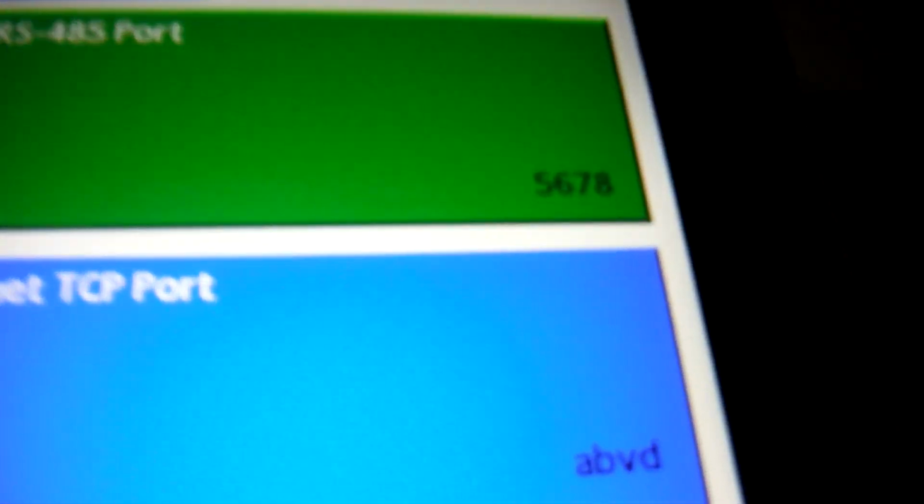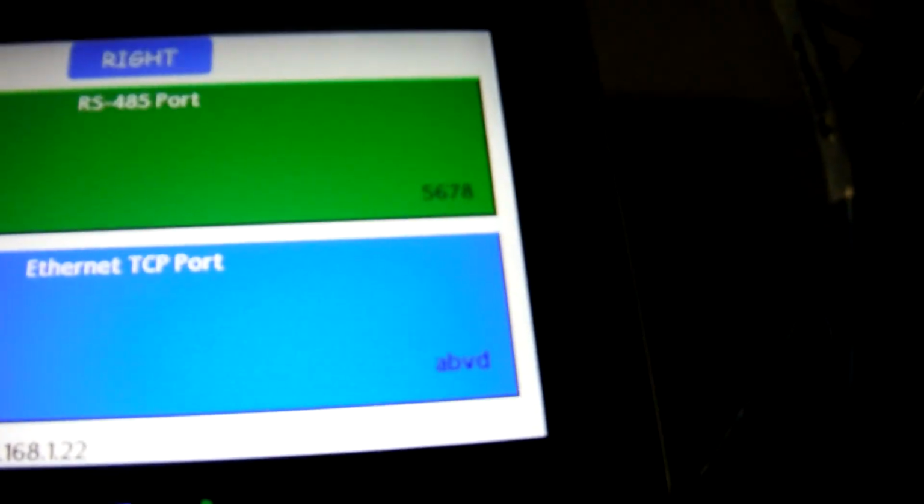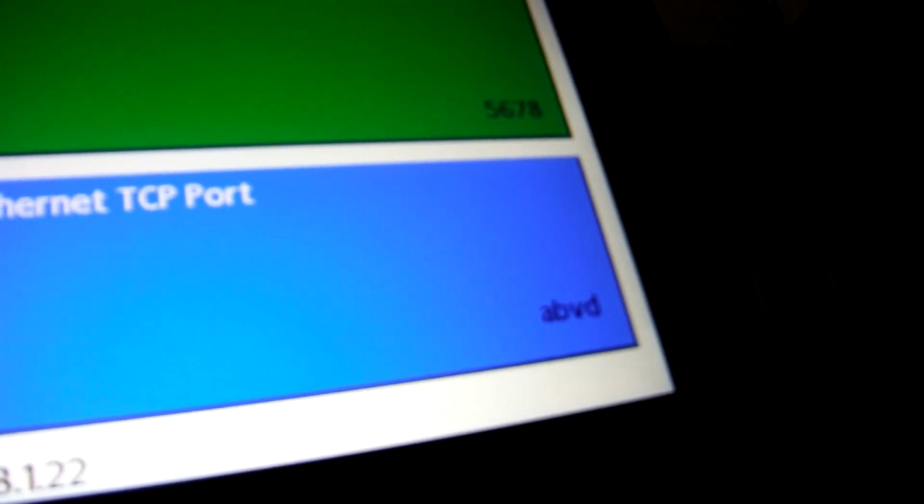Now, if I go to the HMI screen and hit that button, you can see it sending 1, 2, 3, 4 across the screen every time. Here's that screen again, you can see that tag is 5, 6, 7, 8. Let's say I go over to my laptop and type the letters A, B, C, D, and when I hit enter, we should be able to go over here and look. I must have hit V instead of C. Sorry, you can see why I'm not a typist. Nonetheless, if I type away at the PC, I'll hit some numbers, enter, and you can see it reading across.